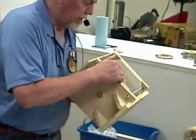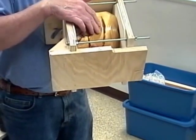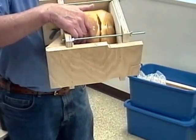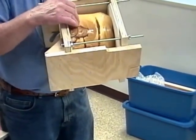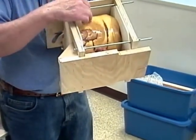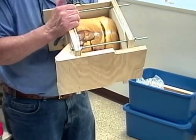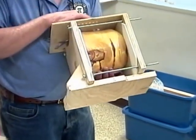I only do one, and the reason for that is that I'm afraid if I cut too much, I'm going to weaken the bowl. This bowl, for example, you take a look at that. That's mostly epoxy. I don't want to get anywhere close to that because I don't know how solid that is. And what I really don't want to have happen is I don't want to sell this bowl to somebody and in a year have them come back and say it fell apart. So I only do the one cut in them.